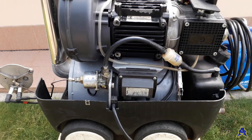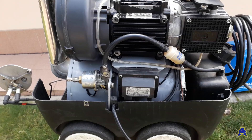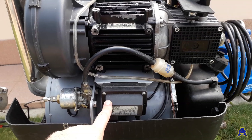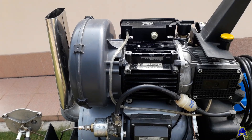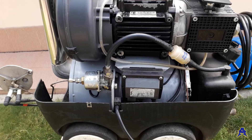This particular power washer is 27 years old, and I found out that the problem — not getting any spark and the water not heating — is caused by a damaged high voltage transformer, because it operates 100 percent of the time. So whenever you switch on the machine, the high voltage transformer is giving the spark, whether you are using cold water or hot water. It makes sense that after years of service you have to replace it.